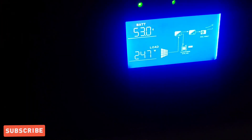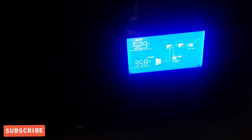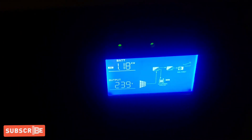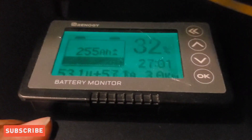The AC unit is not running off the Growatt — it's running on the MPP Solar 5k. The Growatt is just running the fan right now. My car and AC unit are charging on the MPP Solar 5k inverter. On the solar input we're bringing in about 1kW right now. The sun is going up and down with some clouds, which is why the reading is moving — it just came back up to 2.1kW.